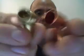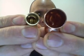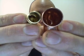And actually, in fact, you're going to get better flow out of copper tube than you are out of the Crimpex. See the difference in the fittings there? See how the Crimpex is constricting the flow, and the copper is way bigger fitting. So you need to kind of know that, because it's going to affect the performance of your fixtures, or it could affect the performance of your fixtures if the water pressure in your house isn't quite as high as it should be. So there you have it.